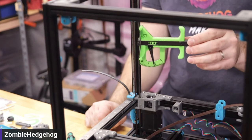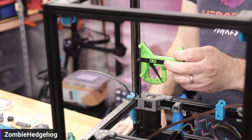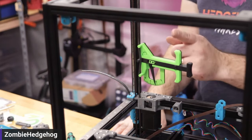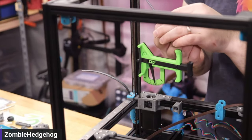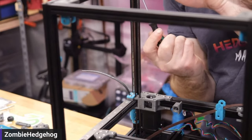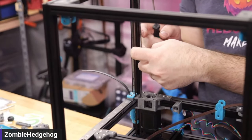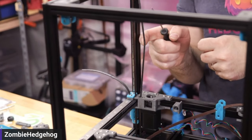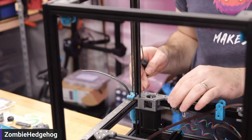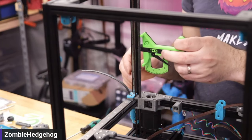For one of these belts you should have around 2 pounds of tension — it should read at two on the tension meter. But I found personally, just the way the measurements work for the Z axis, it should go a little higher. I'd recommend tensioning your Z belts a little on the higher side — around 2.5 pounds. The actual weight of the gantry is going to hold itself, so it doesn't matter too much, but I like to have it a little bit tight.